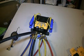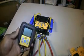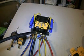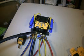Now, later on in the year, I got the Fieldpiece vacuum gauge, and for the most part, I was using it as well. And there are times when I had used both the Fieldpiece Micron gauge and the Micron gauge built inside the manifold, and the numbers were pretty close to each other. I mean, the Fieldpiece gauge kind of read 100 microns less than what the manifold read, but for the most part, the numbers were still pretty close. And so that's all I can think of.